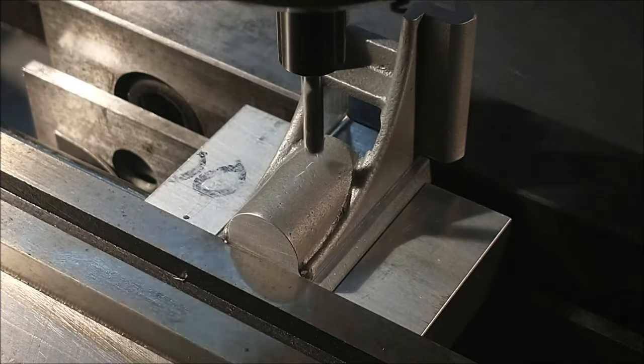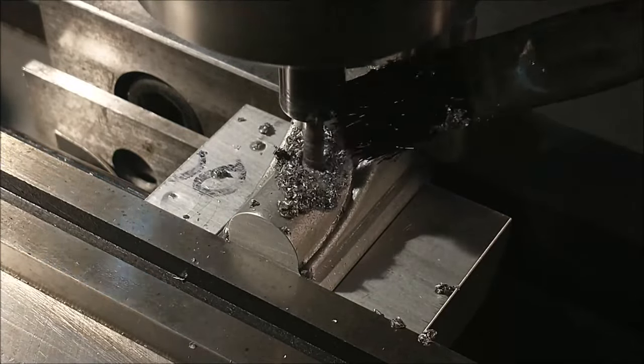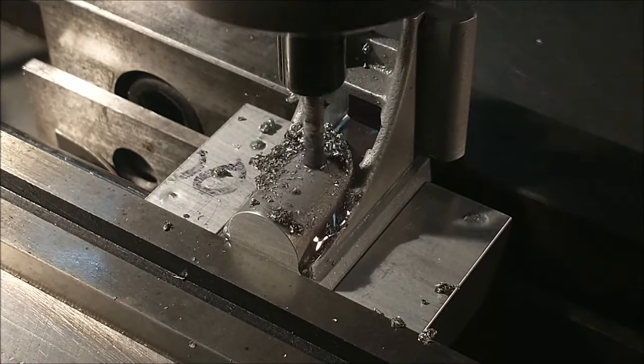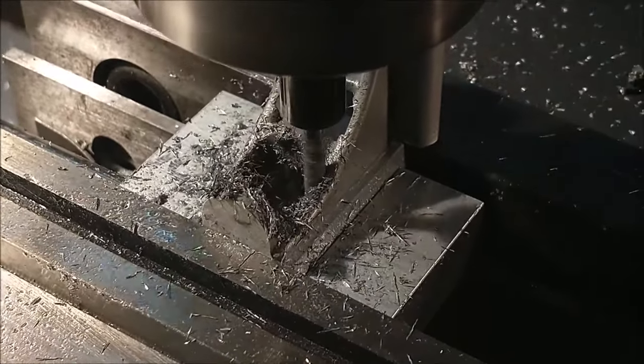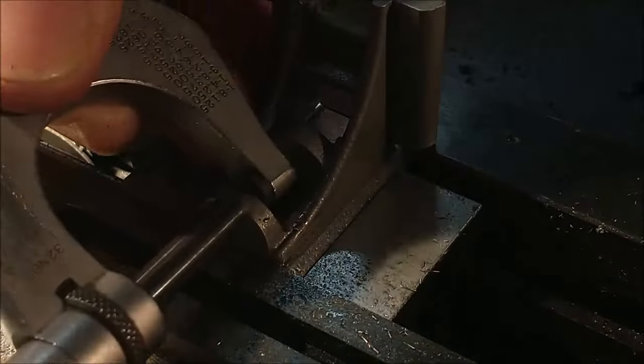The gripping strength of a Kurt vise can easily crush this part and distort any final features. If you are going to hold a part like this, locating on finished faces or critical features like dovetails, hold it just enough to hold the part against the machining forces that will be applied. Don't overdo it or you will damage the part.